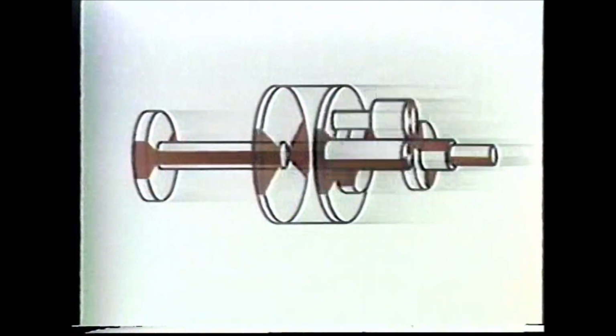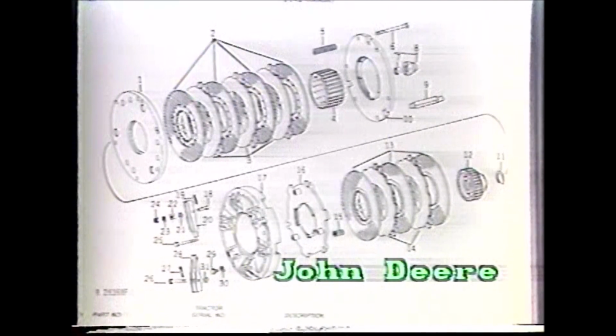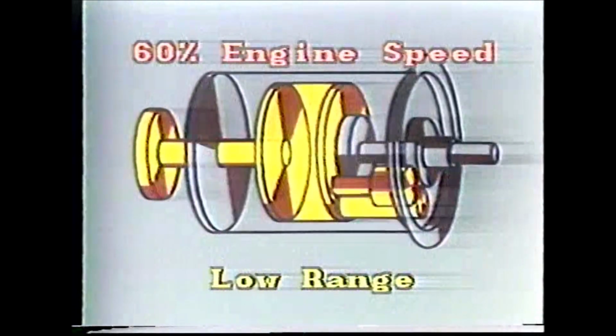As you have watched us build up the range power shift, you have to admit it's simple. There are no elaborate disconnect clutches that work in oil or are hydraulically actuated. Just a simple torque limiter to reduce abrupt or lurching speed changes under peak loads. The torque limiter, together with the input sun gear, provide the input to the R.P.S. from the engine. The outputs are simple too.